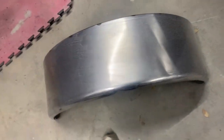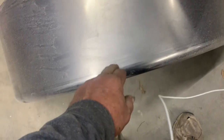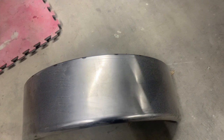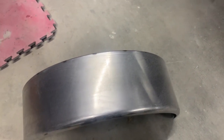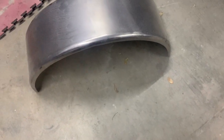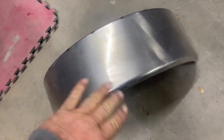So I'm going to use the inside area, this area here, for the Impala, and I'm gonna use the outside here for the Cadamino. So I'm gonna cut this off at 3 inches, so I have 2 inches of overlap on a 16 inch strap I'm gonna put around it. So I'll give us 16 inches of tub on to go up to what is already existing on the car. And then I'll put a blank piece on the inside so I figure out how big I need to make it. And it'll have wheel tub with a nice rolled edge on the side.